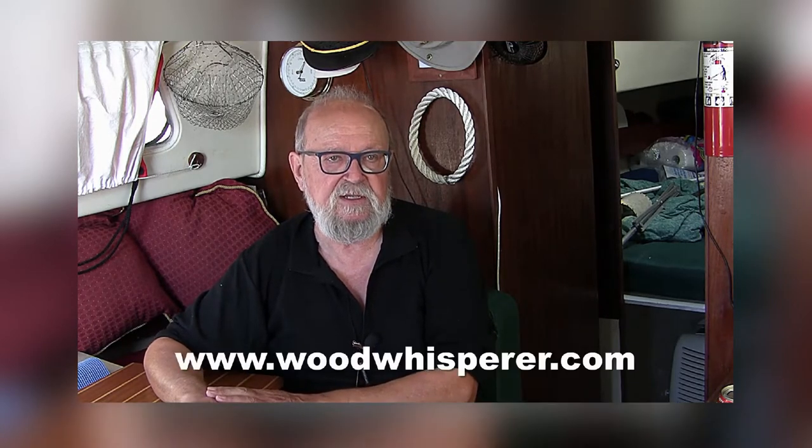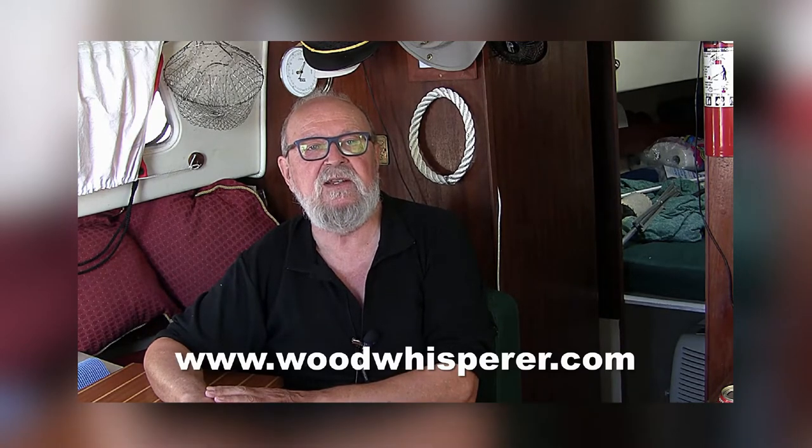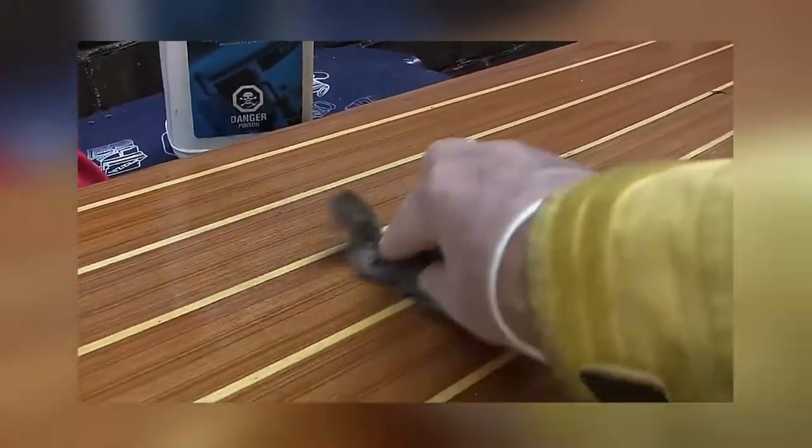People have said that applying varnish is like painting with honey. So I've taken a tip from the Wood Whisperer and cut the varnish with 50% paint thinner, and I'm going to apply thin coats with a cloth rather than a brush. But I'm getting a bit ahead of myself, actually. First, I thoroughly clean the previously varnished wood with thinner and fine steel wool. Once I finish that, I clean it off again with a rag and more thinner.